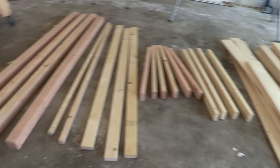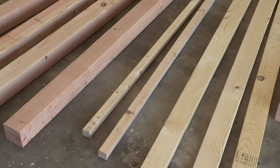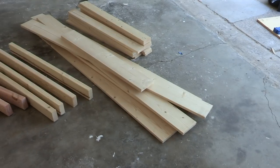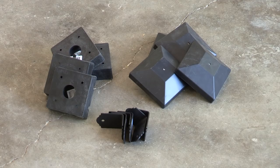Here's all you need to build this DIY outdoor bed: four 4x4s, two 2x2s, five 2x4s, six 1x6s, and seven 1x4s. We've already made our cuts so let's build it. Hardware is always optional — we've got some bases and caps for the 4x4 posts and some decorative angle brackets.